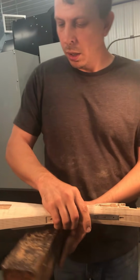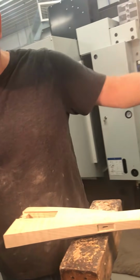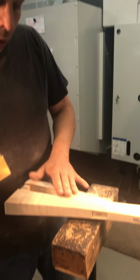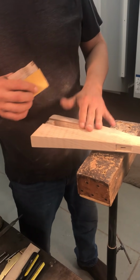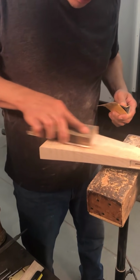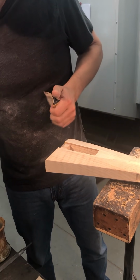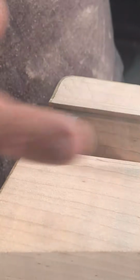the area along the box and the butt plate needs a little attention. So again, as I mentioned before, the area where the box lid mates up with the stock is perfectly flat. So we can come along with our sanding block and just make sure that's flat. We've already done this previously, but we'll do it again. And then in a previous video, we showed how we scribed a little line around the edge of the box inlet, or the perimeter of the box lid.